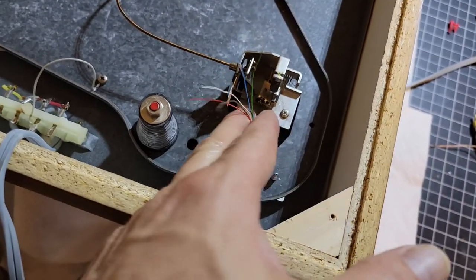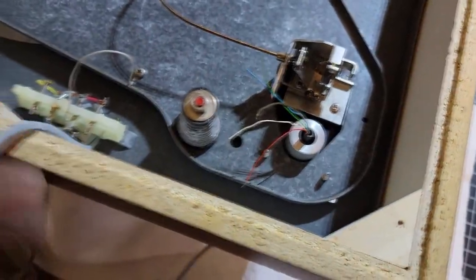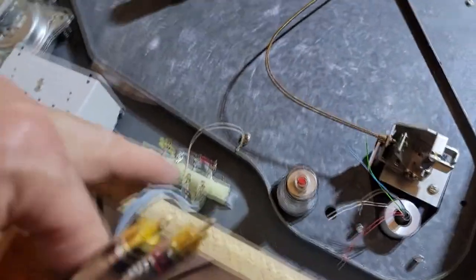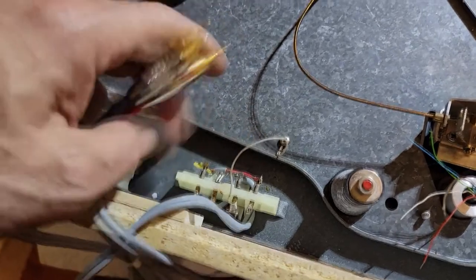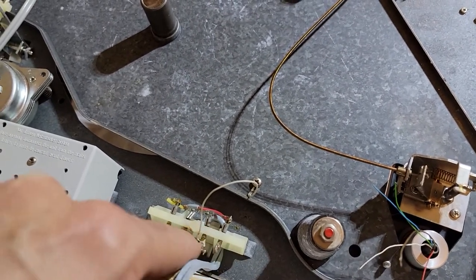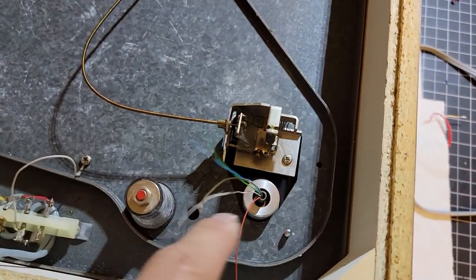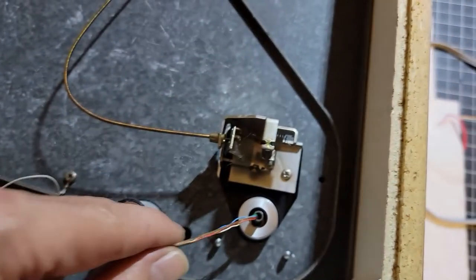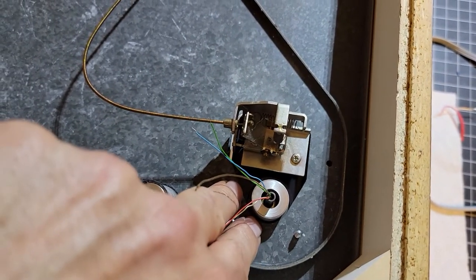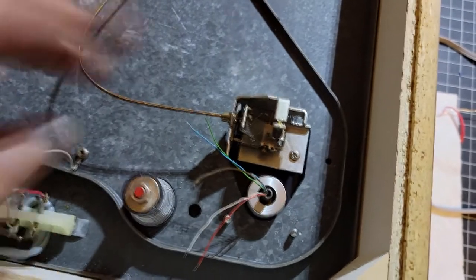So there you see the dilemma, where I have short leads, and on my other Thorens turntable, the connection block assembly for connecting the RCA wires that comes up through this line, goes into this block on this side, on the outside here, and the lead wires on the old arm came all the way over here and connected up on this block assembly. Well, in the newer Mark I turntables, the later run, I guess, of them, that block assembly was actually right here underneath the tone arm pivot point. So you didn't need a long lead in order to run the wires.